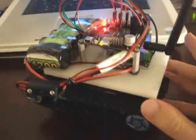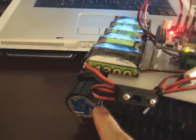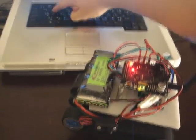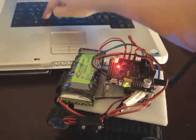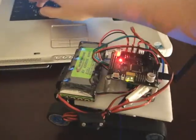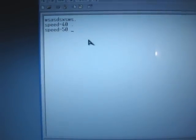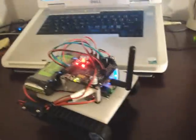I've already uploaded the program to the Axon. You can download the program straight from the Axon 2 website along with all the other demo programs. Now we're going to control the wheels using commands from the PC. For example, if I push W, it moves. S for stop. I can go left, right, reverse, forward again. I can also change the speed by pushing this button. Speed is now set to max and I can go forward again. There you go — a remote-controlled robot, and it only took a few hours to make.